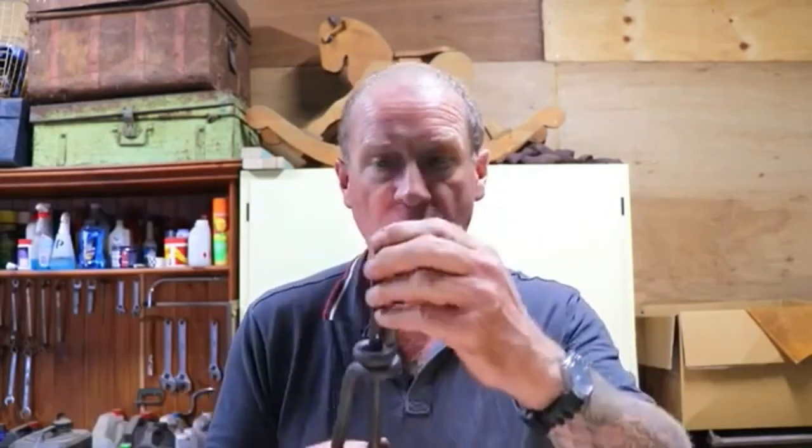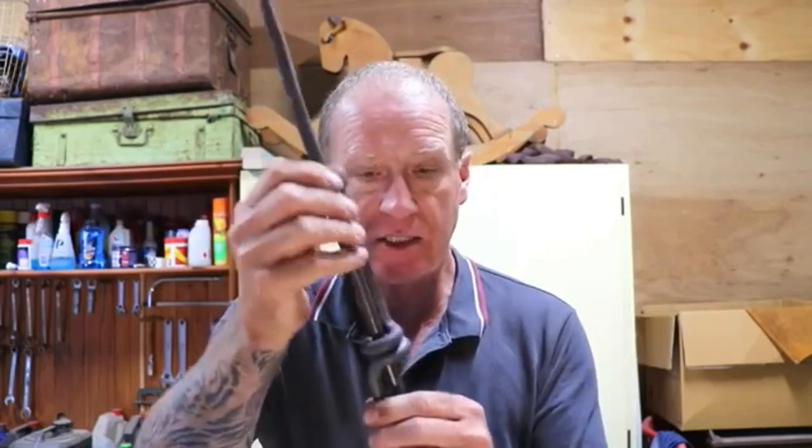This type of jaw, or nib, or whatever you want to call it, lends itself to any shape that any regular set of tongs has got. You could upset this and make it into a box jaw tong, bolt tongs, straight nibs, scrolling tongs, you could make anything out of them. And all you would need is this one, of a similar design. They only take about 10 minutes to make. These are very simple, very easy.